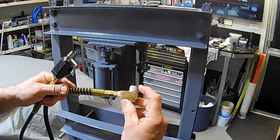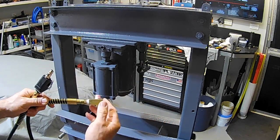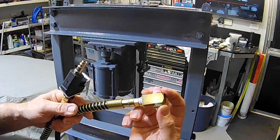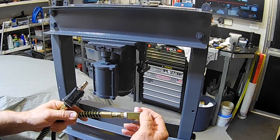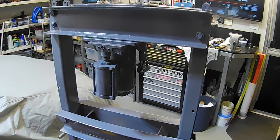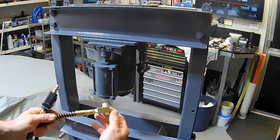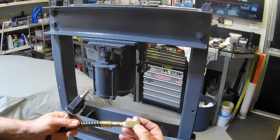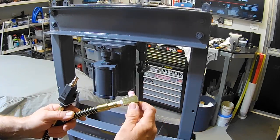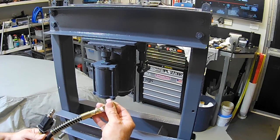It's a taper fitting on here, which goes into a hole in the back there, and they had a whole heap of thread tape on it, like heaps and heaps. And I don't know what the reason why is, because it should just seal up. Other than if the tapered thread's been sort of cut too deep and it doesn't seal by the time it bottoms out. So I've just slapped a whole heap more thread tape on there just to see, I guess.